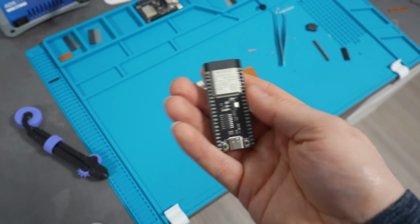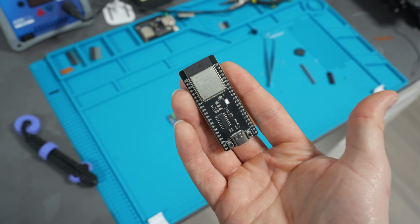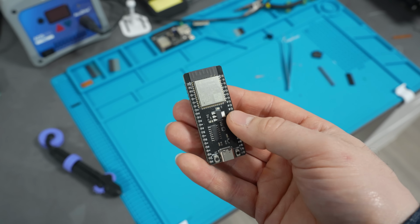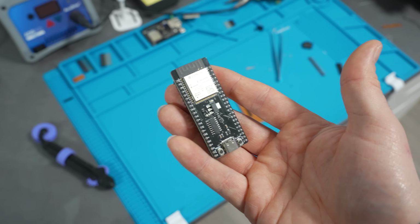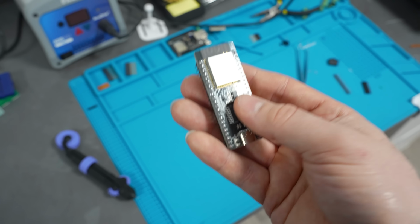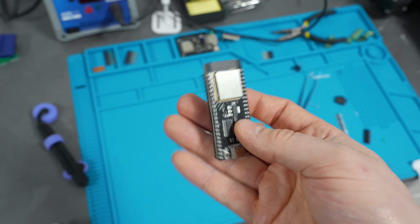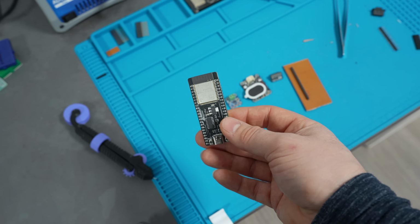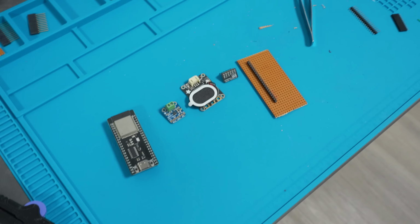And we're actually using the ESP32S3, and this one has PS RAM, which is going to allow us to run the wake word for Assist directly on the chip. Now, we could offload the wake word processing into Home Assistant, but if we use the S3 with PS RAM, we can do the wake word directly on the chip and save Home Assistant some processing power. We're also going to be activating like Bluetooth proxy and all that good stuff, because the S3 has a lot of processing power and it can kind of handle that.